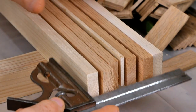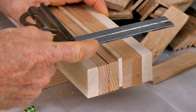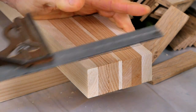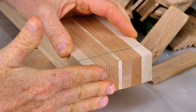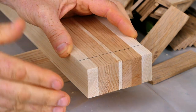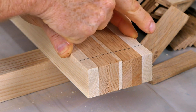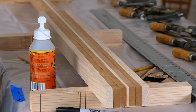Starting the process: I'm going to square up all the pieces on the end and then I'm going to put the square on top of the paddle blank and mark this with a pencil. This mark is helpful for a couple of reasons: one, it makes sure that as you're clamping this together, as long as this is lined up, you know that the end is square. But also, if you've oriented these pieces in a specific way for purposes of flex or because you needed the grain to be a certain way, this makes sure that all of these pieces are still oriented the right way while you're clamping.